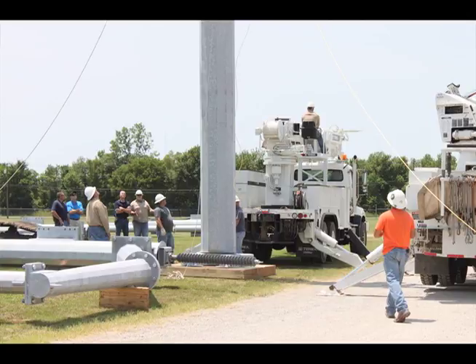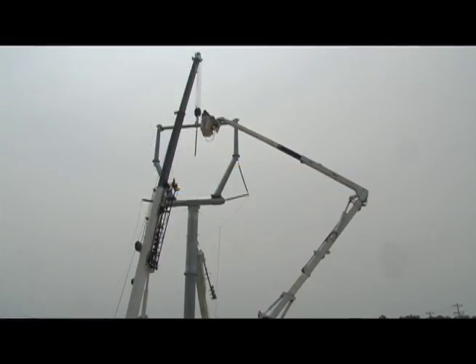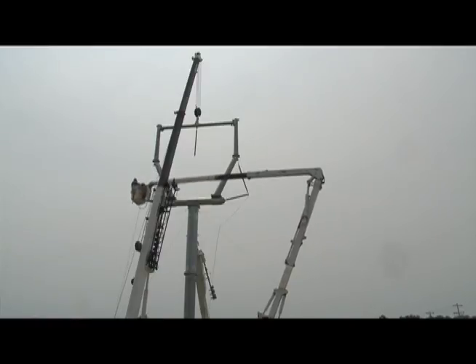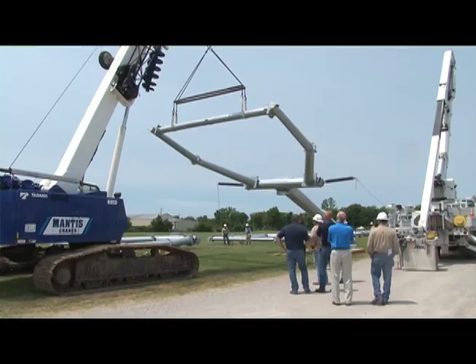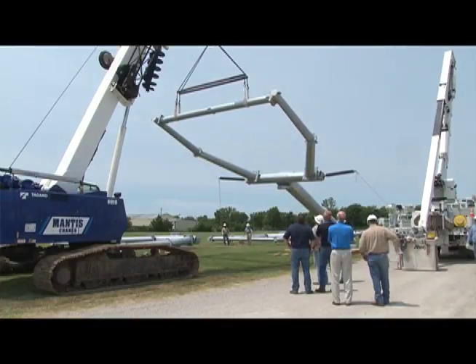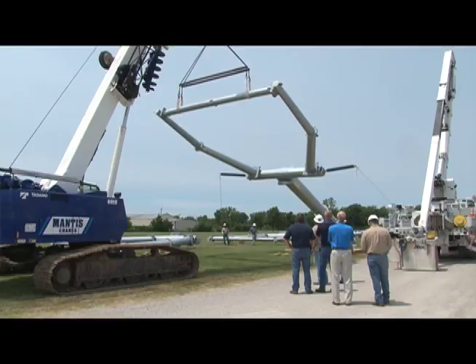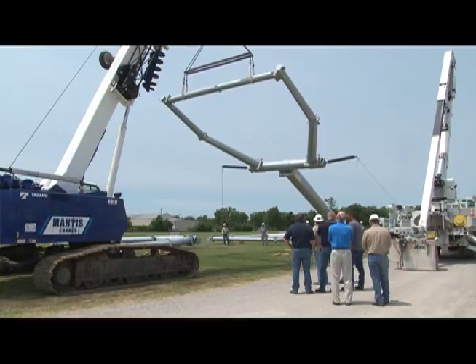We're also able to use it for 161kV lines if we need to, if we have a power outage or some kind of failure there. We did a trial over at Pelko where we had one of our crews go over there and try to construct one, which was a good idea because we wanted to see what kind of problems came up. What we found is our crane is not tall enough to do multiple sections, so we need to construct it with single sections, and also it can't handle the weight.